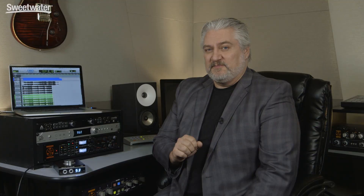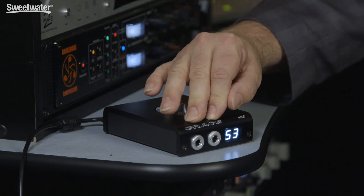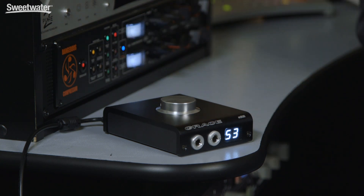The M900 operates at 24-bit resolution and up to 384 kilohertz sample rate when using PCM audio. It also operates from 64 to 256x when doing DSD. We have two headphone outputs on the front panel and those are in parallel so you can use both simultaneously. When you plug into the right one it disconnects the monitor outputs, effectively muting your speakers, but you can plug into the left one and still use your speakers so you can switch back and forth.